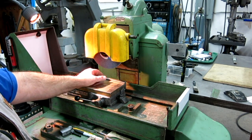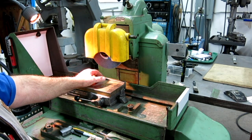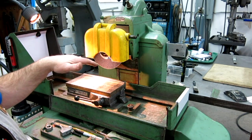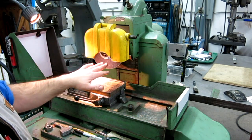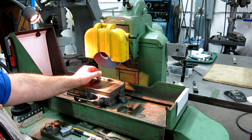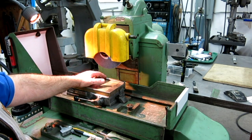In the case of that vise, we were roughing and putting heat into the system, and we weren't attempting tight tolerances with that initial grind. We were trying to establish some reasonably square surfaces and get it down to a ground finish all over. That way we can go back and do the really fine work, switch wheels, and go for fine finishes and tight tolerances. So think of these things as a system, and depending on the tolerances you're working to, they may need equilibrating to perform at their best.